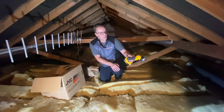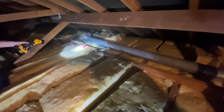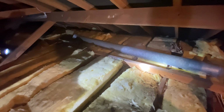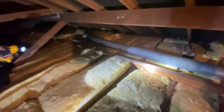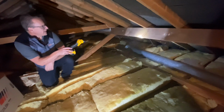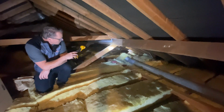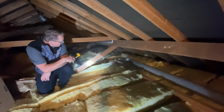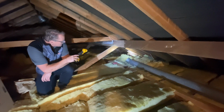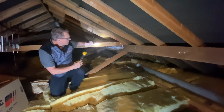And then we've got this timber here, Charlie. This here is called a binder. And because our ceiling joists would technically be overspanned, a binder's put in there to take a lot of the spread out, a lot of the bounce out of a ceiling joist, which means we can have smaller timbers. Now the purlin here is supported on struts. These struts aren't doing a great deal of work because they're less than 45 degrees, so the loading is still wanting to push down slightly. And then right behind me we have this collar cross tie.